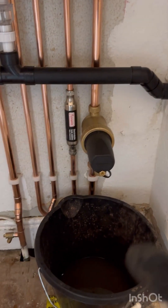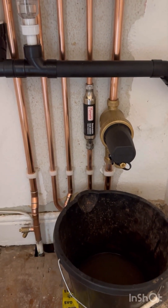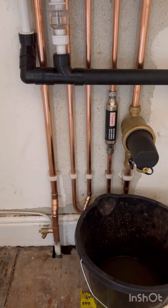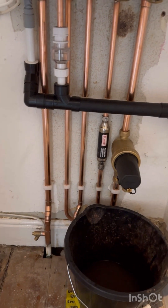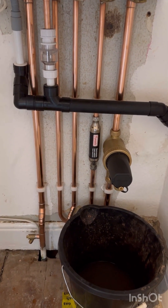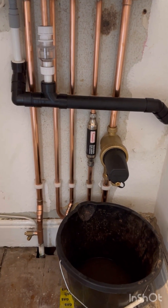That is all tied there. But in my instance, I've drained the whole system — I've drained it from the radiators downstairs. So my drain off is now shut. What I'm going to do, which you may not do, is I'm going to dose the system with protector and inhibitor.